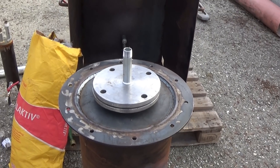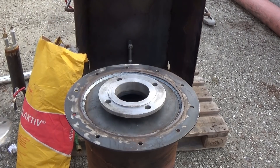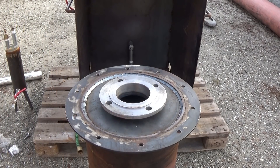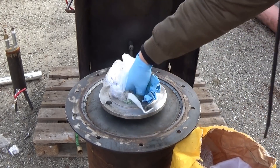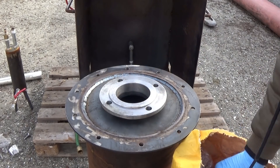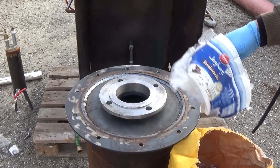The first design had an insufficient sealing flange and sealing combination — it tended to catch fire. But I was able to weld a PN6DN100 weld neck flange into the system that can seal quite well with just a normal gasket. So let's get started.